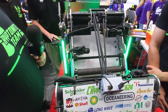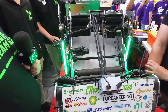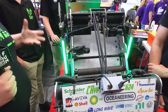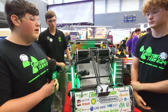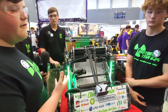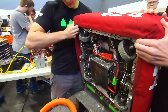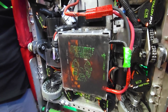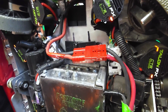That's really impressive to keep everything in such a small package. How hard was it? One of the main design constraints was finding a place to put all of the electronics — the battery, the RoboRIO, and everything. To improve our center of mass and keep the weight down low, we had to put the battery underneath the robot. We put a cage for our battery on the bottom of the robot that basically encapsulates it and locks shut, keeping the battery secure.